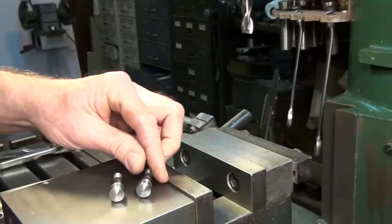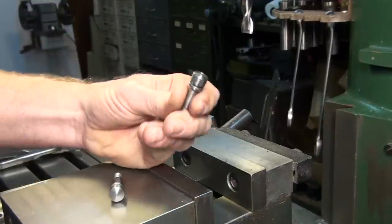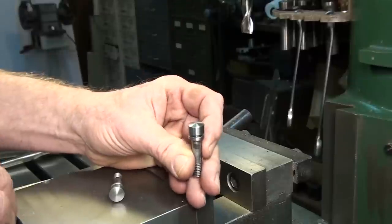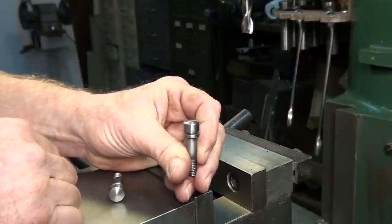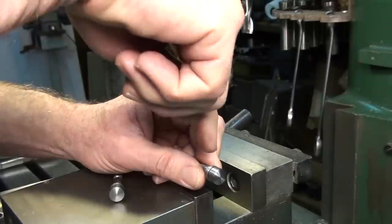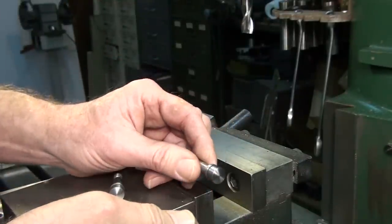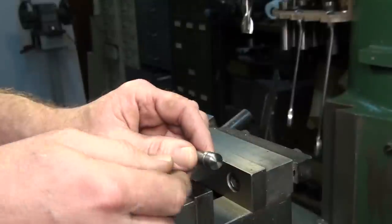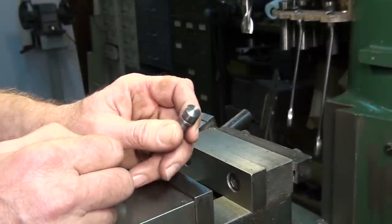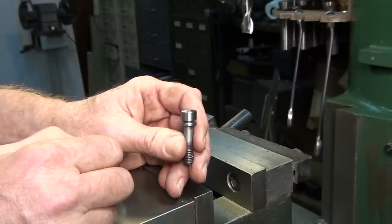There are a lot of ways we can do that. We can put a dividing head on the table here and mount the thing vertically in the dividing head, and side mill, index 90 degrees each time, side mill, index, side mill, till we get around our four sides. We can hold it horizontally and end mill. That'll work as well, and index it four times 90 degrees. Problem with end milling is you're going to get a rougher surface finish than if you side mill. So I think probably we ought to stick to mounting the part vertically and side milling it.